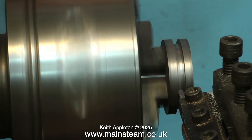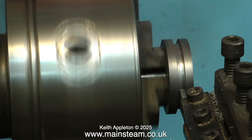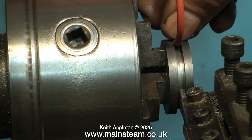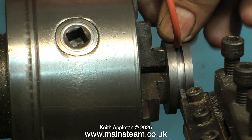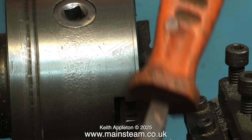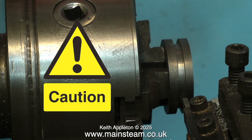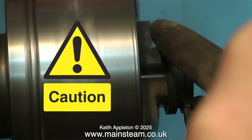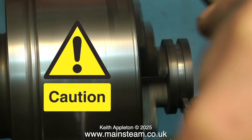Finally, taking a finishing cut across the groove. The o-ring is a good fit — perfect, just sits in there, no nipping, and should give us a great piston seal. The next thing to do before you remove the piston from the chuck is to clean up the piston slightly with a file to remove the sharp edges. A 90 degree angle cut on a lathe is razor sharp and easily sharp enough to cut the o-ring when you're fitting it. Make sure the file has a handle and keep your hands well clear of the chuck.